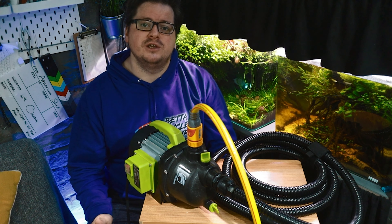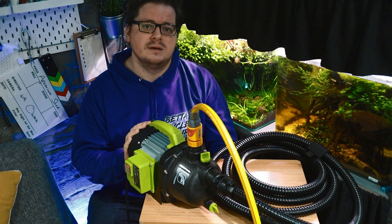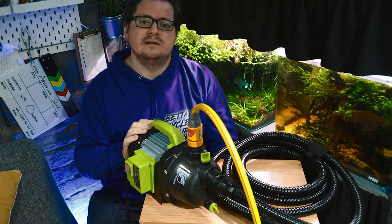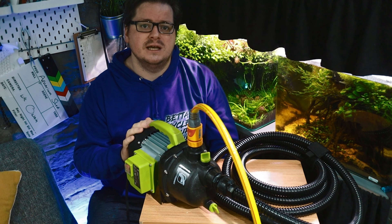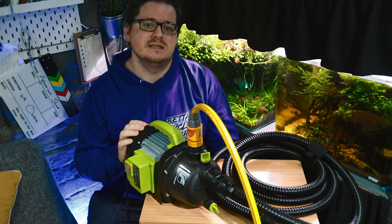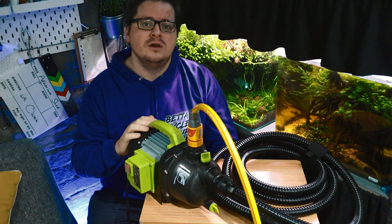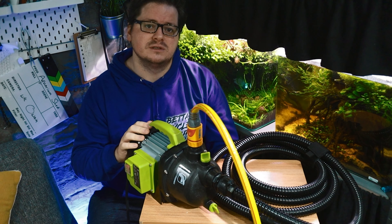The only real thing to be aware of is that you need to prime the pump before use so there is water throughout the intake pipe. There's a small cap by the inlet that you pour water down until full. Because my pump is in regular weekly use I just primed it when I first got it and it has worked flawlessly ever since. In terms of the outflow hose, I just close off the end spray gun, roll the hose up and keep it permanently attached to avoid water leaking from the primed intake hose.